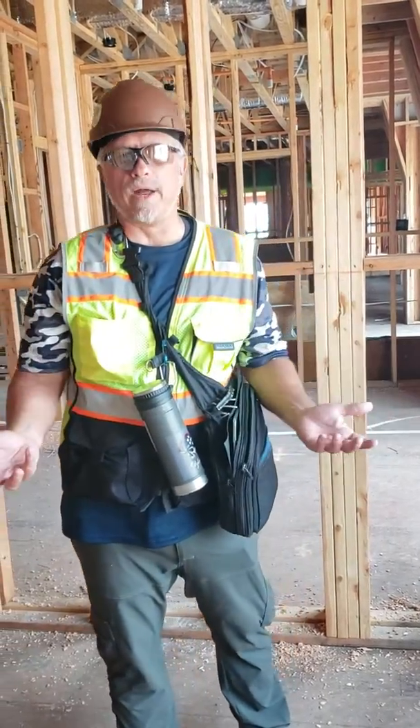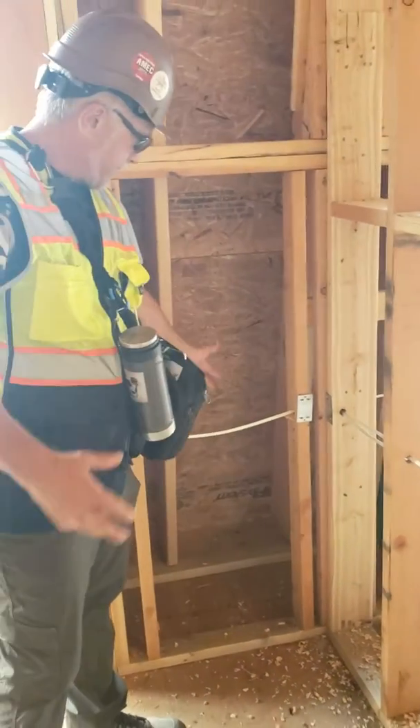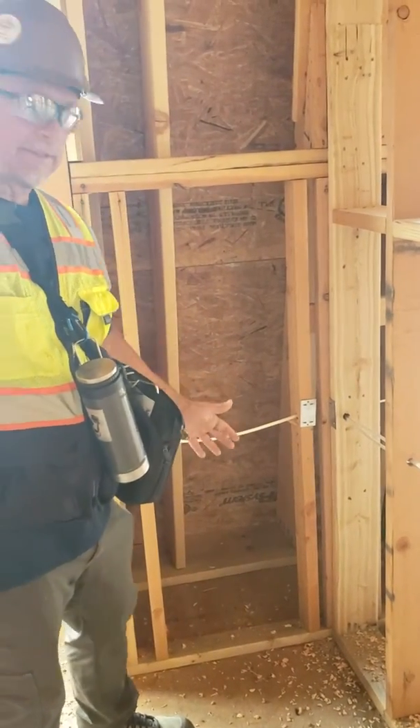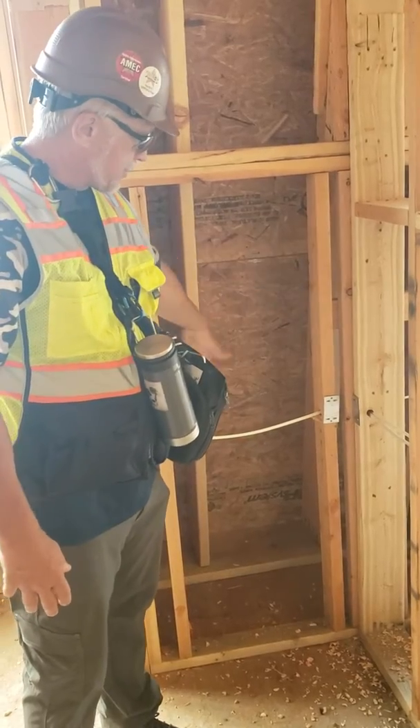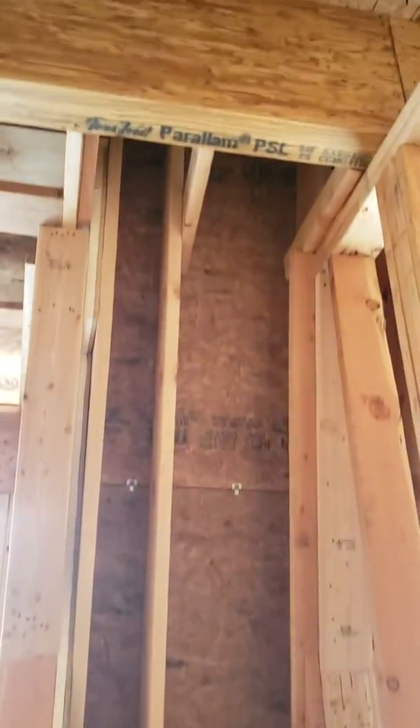In addition to unit compartmentalization, this is a Grade 1 rating, which means the insulation has to be completely touching on all six sides. This could be 30 inches deep, and we're going to have to fill that with Grade 1 insulation on all these gaps, which are going to be very challenging.